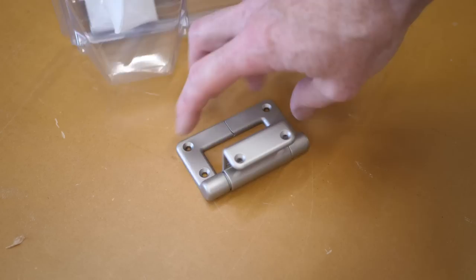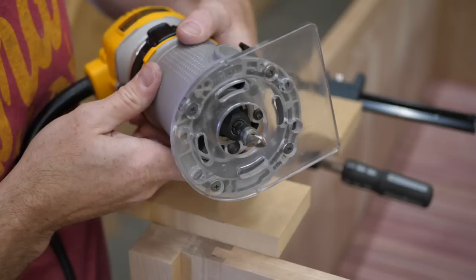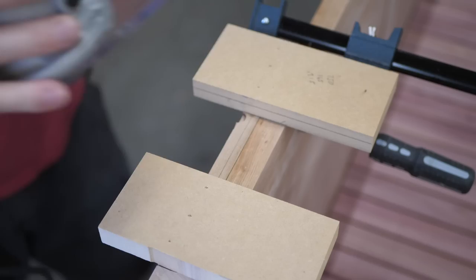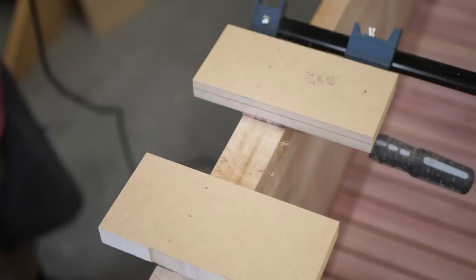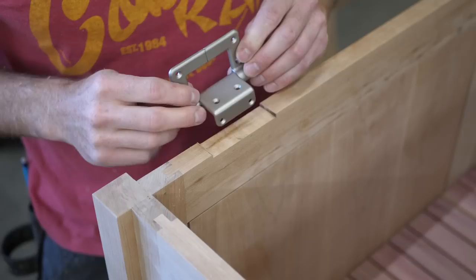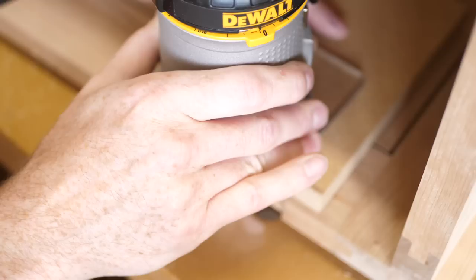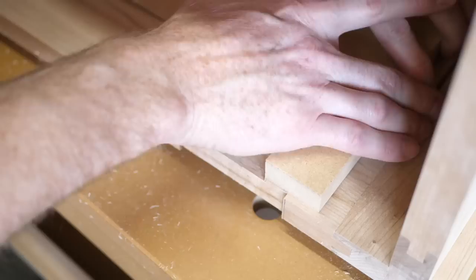For this type of project I really like torsion hinges — they hold the lid open and prevent it from slamming shut, available at Rockler (not a sponsor). I'm using a Freud hinge mortising bit. The hinges are designed for three-quarter inch material, but my panels are seven-eighths inch, so some routing is needed. The first jig cuts a seat for the hinge when the lid is closed and flush with the chest top; the second cut reduces the material thickness down to three-quarters of an inch.